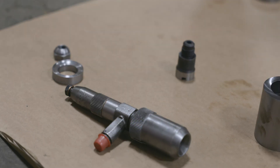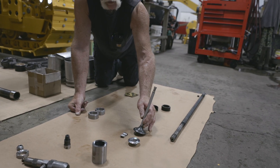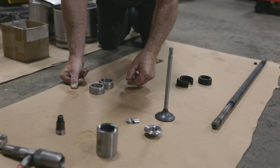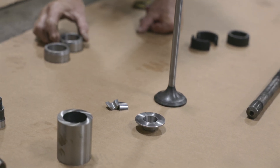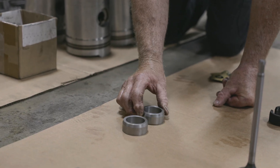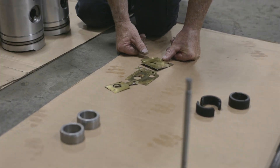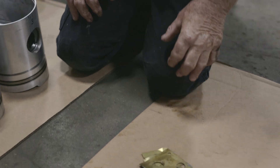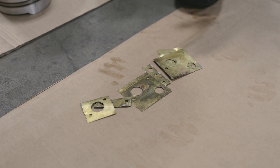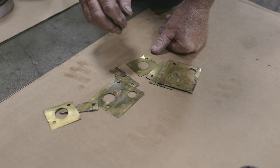We also had to have valves made from top to bottom. Once they were done, we had to have our rotor caps and keepers all made with them. These here are the new rings that go in around the head bolts when you're done, to take up that space. On the block itself, we had all the main bearings taken out and rebabbited so that we could rebore. Everything is a shim-adjusted situation on there, so when you get done you shim-adjust.